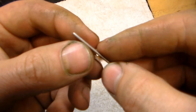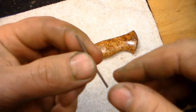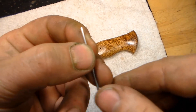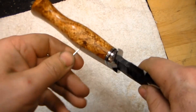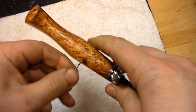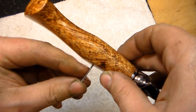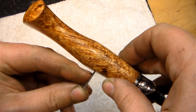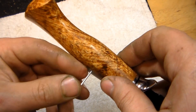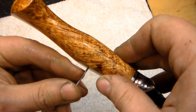The way to do this is to take the pin, chamfer and polish it, and form a head on one side before it goes through the handle. We need to get it cut to length first — push it through the hole, and then the big question becomes how much excess you leave on either side of the handle. That really comes down to personal preference, like how much you're going to mushroom it out, and experience to know where exactly that's going to be.